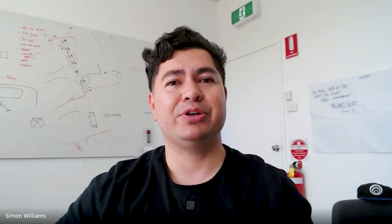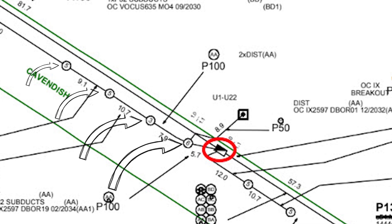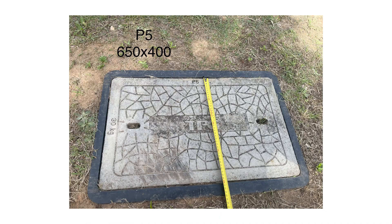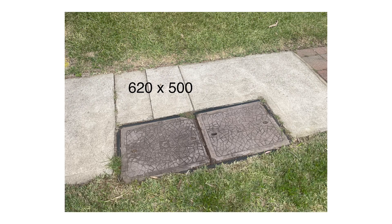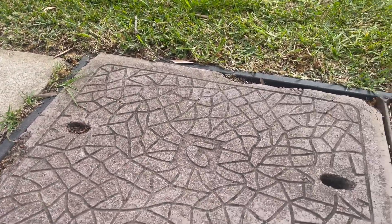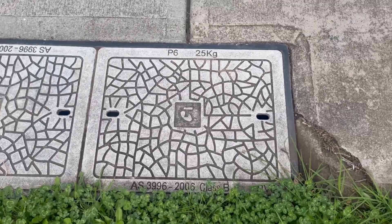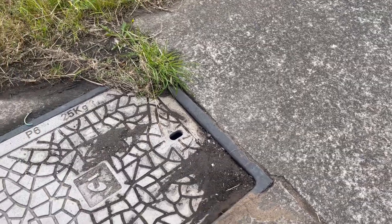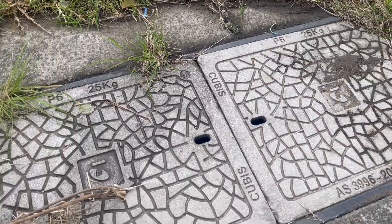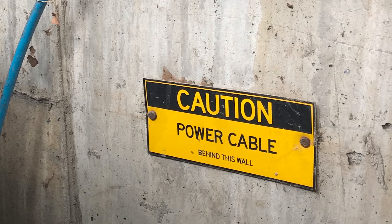There's a lot of pit information — you'll see round circles, and inside those circles you'll have numbers or letters. They could be one through five. Generally they're like a four-pit or a five-pit, which is a single-lid rectangle, and the numbers represent the size of the actual Telstra concrete lid. They go up to multiple concrete lids — a six-pit, eight-pit, and nine-pit, with multiples of two or three concrete lids. The larger pits on the plan are rectangles with a diagonal black and white cut through them. These represent the manholes or footpath access chambers, which are quite large and generally housing the major fiber-optic cables, so be careful around them.